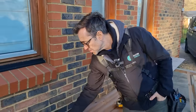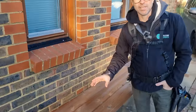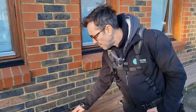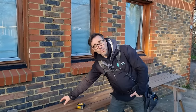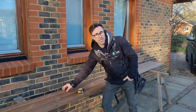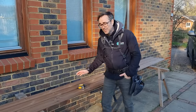This one has actually got knots that are missing — a typical characteristic of softwood, and it should be expected when you buy cladding or any softwood. You should always allow for that. This bit we don't need to discard because some of our reveals around the window we will take from these strips. We might need a bit which is 60 millimetres or two and a half inches wide, and we can rip that from there by just cutting those knots off. So it's not wasted — you can use it.